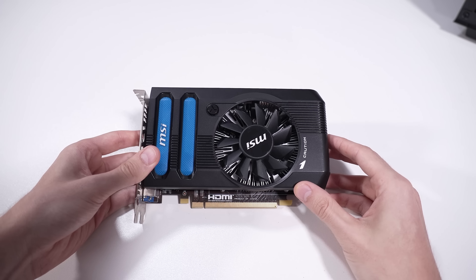Thankfully, this isn't a super complex card to disassemble — just four Phillips screws here, spring-loaded to keep tension in check. We'll get these four out and then detach the entire shroud assembly from the PCB. You can see we've already broken the warranty sticker. When we filmed the original video with this card, this seal had never been broken — a 10-year-old card that had never been opened, thermal paste had never been changed. It was actually in decent shape. There we go — the PCB and the shroud separated. We'll detach the fan cable here and clean up the thermal paste next.